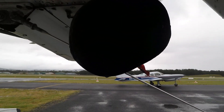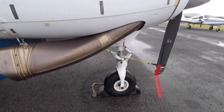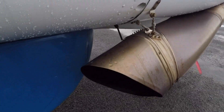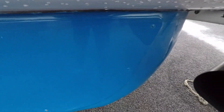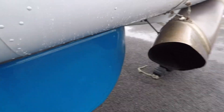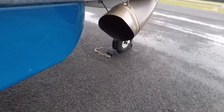We'll go and have a look at the exhaust on the other one just for a comparison. Here on the wheeled machine you'll see that the exhaust angles out a little bit more to the side, because if we had the seaplane exhaust it'd be pointing pretty well at the pod there, and on the float machine the struts come down about here so we'd be melting those.